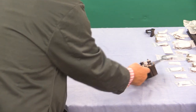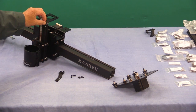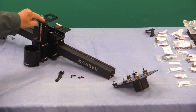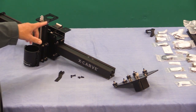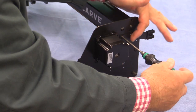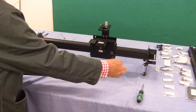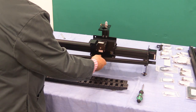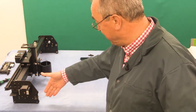Now we can go ahead and fix the other end plate on. Do take care with things like the micro switch connectors here - as you're handling this, don't put it down upside down and squish one of these, so just take a lot of care. Once all four are nipped up you can then give them the final tighten. We're now going to take the 750 millimeter length of rail that comes with the drag chain and attach it between there and there.